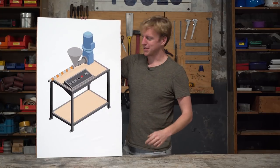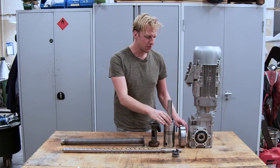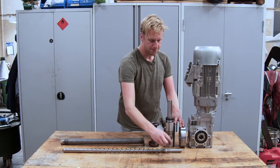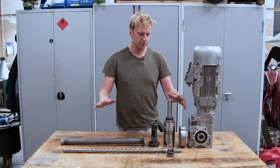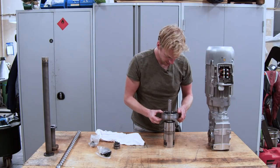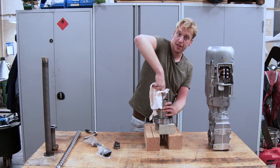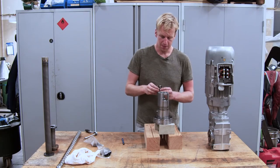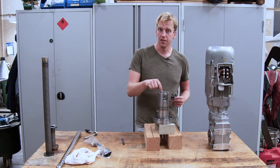So we've made all the parts and all the sub-assemblies, and now we're going to make one proper machine from it. We start off by connecting the bearing body and shaft assembly to the motor adapter. Then we will install the screw with the clamp bushing. Then we'll slide over the barrel inlet assembly, slide over the barrel, and the final extruder assembly will be slid into the motor and we will tighten everything afterwards. I'll make sure that everything is clean and degreased. I'm going to use the clamp bushing to clamp the screw into the coupling shaft before assembling the barrel inlet into the bearing body, because now I have easy access to the bolts.